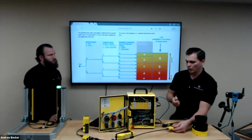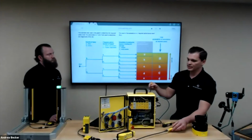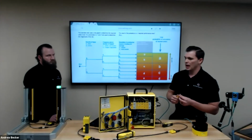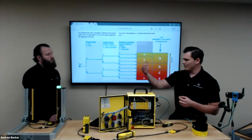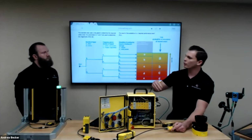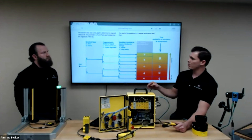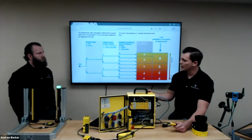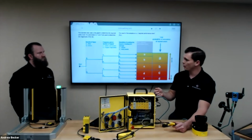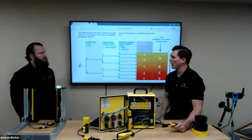So typically what you'll see is I can add up to 32. If I build a machine that has 20 e-stops or 20 door switches, that's the max I'll ever have, but my standard is 10, we can pre-populate 20 of them in the software. And if on your first system you only put 10 on, you won't have to change that program. It'll automatically recognize that there are only 10 there. But as you add more of the same sensor that's already pre-populated in the software, you don't have to go back. So it's very flexible from that standpoint.